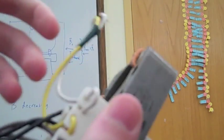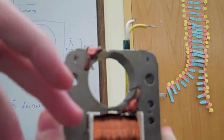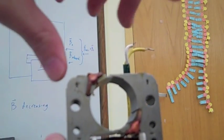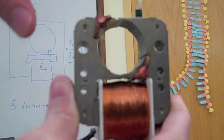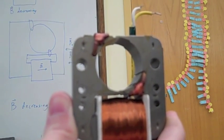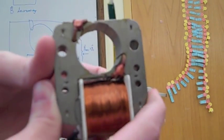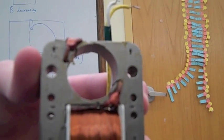The current runs through the wires and into the solenoid and creates a magnetic field in the solenoid, which in turn creates a magnetic field in this piece of iron here. And this magnetic field in the iron induces a current in the copper shadings, which in turn produces a magnetic field which opposes the magnetic field inducing the current. And let's take a bit more in-depth look at that.